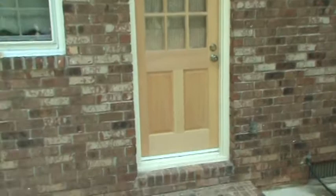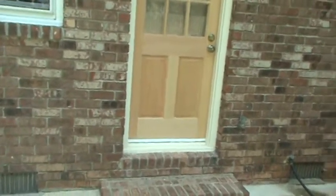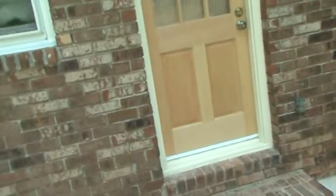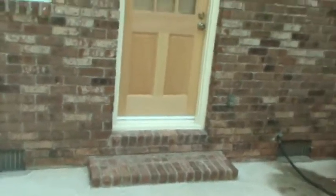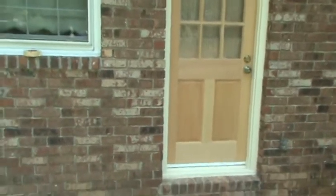This is a brand new solid wood door. A lot of contractors would prime this with latex primer and it'll bleed through. There's a lot of what we call tannin in pine and softwoods, and it kind of forms dark brown circles or stains and knots that'll come through the paint job.